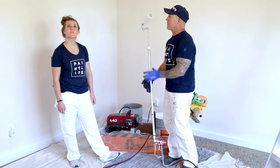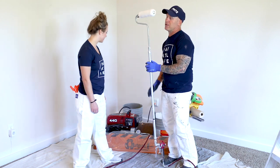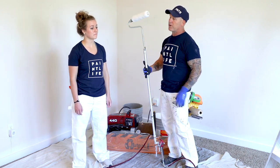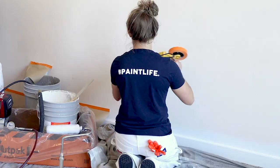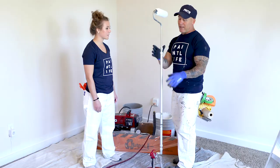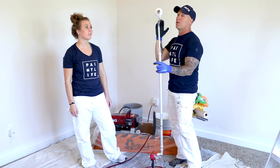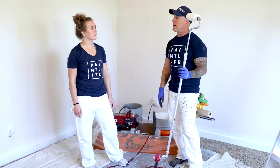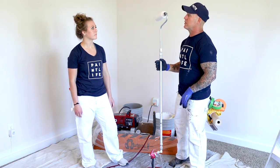You've got lights up here so we're gonna have to cut around them — we'll need a bucket and brush to hand cut around the lights. We're also going to use a hand masker. We've got drop cloths on the floor because we don't want to get any paint on your brand new carpet. We'll run nine-inch paper and tape along the wall to cover the baseboard so we don't get any drips. We're gonna cut in the edges first because we're doing ceilings before walls — that way we don't have to cut in upside down.